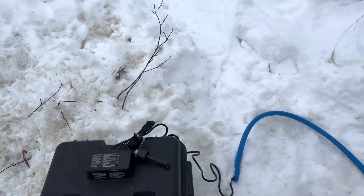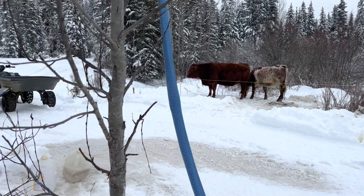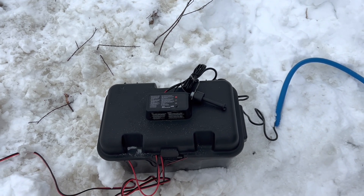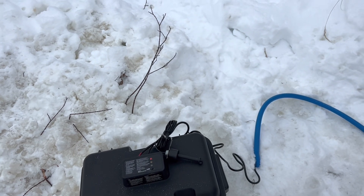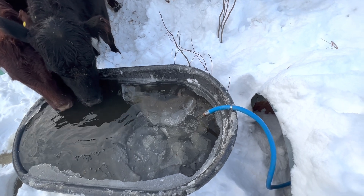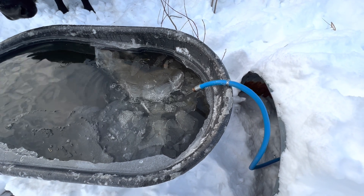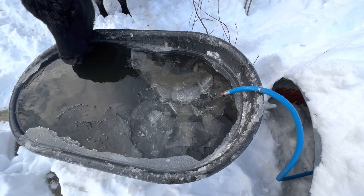Happy all around with this. The cows have got water now. And if it dies kind of prematurely, I'll just get the little expansion pack for the solar panels to add another panel. It's all an experiment — we'll see how this goes, just add to it as we go. I made one change: I made it so that the water going into the tank is a little bit above it, so that generates some bubbles, which helps prevent ice from forming. The constant flow should help too.